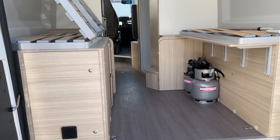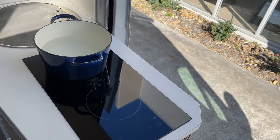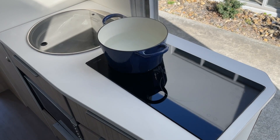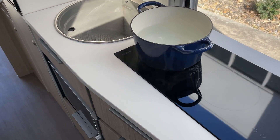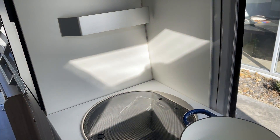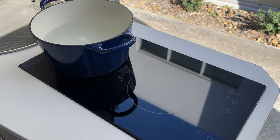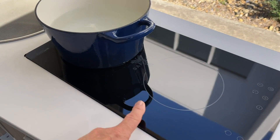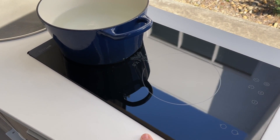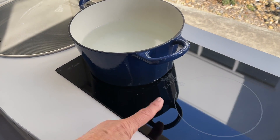Let's go and have a look inside in the front. The customer wanted an all-electric kitchen, so the complete bench top was removed and replaced — it matches perfectly — and we put in the double induction cooktop. It's 2000 watts total: 1800 watts here and 1500 watts here, but limited to 2000 watts combined. If you put something on the front element it will reduce the power on the back to balance out.